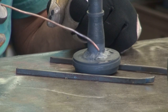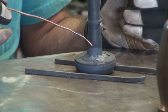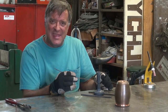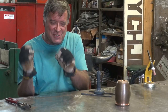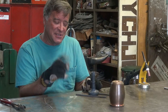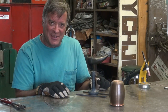What I'm trying to do is just get a big enough fillet in here so I can go back to the lathe and turn it down into a nice, smooth, even surface — make it look like it was machined that way, all one piece rather than having a weld in there. Even if I could do a gorgeous, pretty little copper weld, I wouldn't want it to look like that. I want to machine it all in so it's just one piece. Let's go to the sink to cool this down — it still makes my gloves smoke when I touch it — and then we'll go to the wire wheel and buzz it off real quick. You can see it's all bright and shiny again.